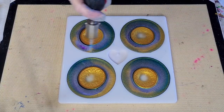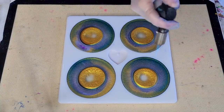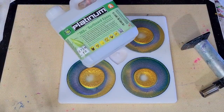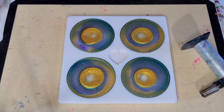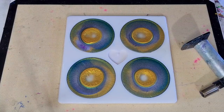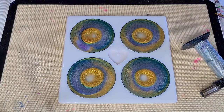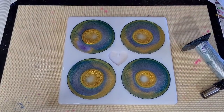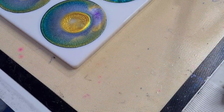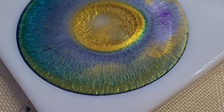All right, last little torch. It's a pretty low bubble, this resin. It's a low viscosity, which means it's very thin. It's this one, the Platinum 360 Plus Surfboard Epoxy. Doesn't do the amine blush, which is great. And it has low bubbles. Now let me just get my gloves off, and I'm going to take you down and show you what they're looking like at the moment.